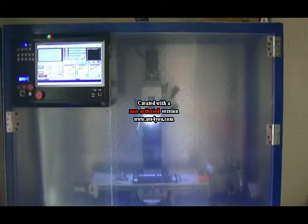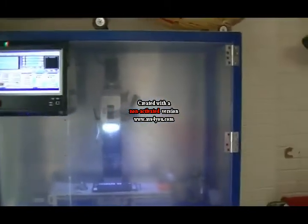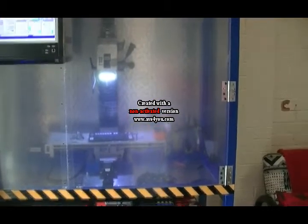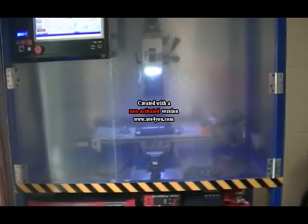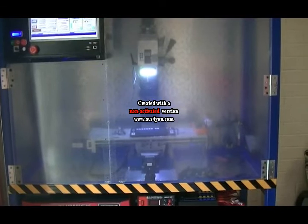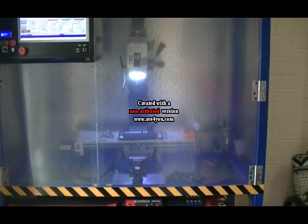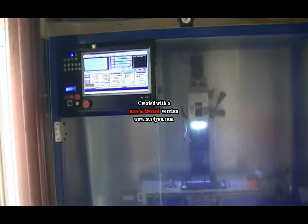What I have done is build a custom built box, totally enclosed with the Perspex front, 3.5mm, hinged doors that lift off, ball screw conversion on the mill, NEMA 570oz motors on all axes, ball screw conversion, and a custom built controller box.